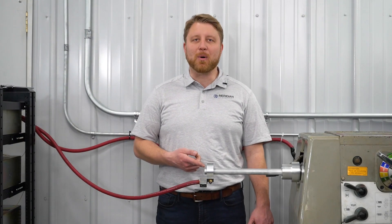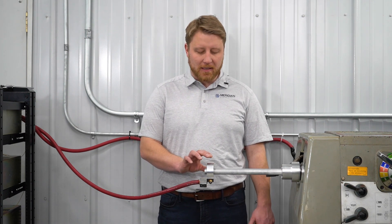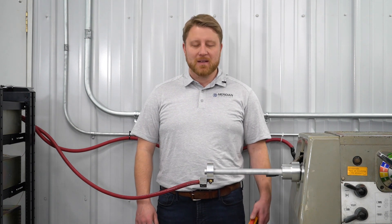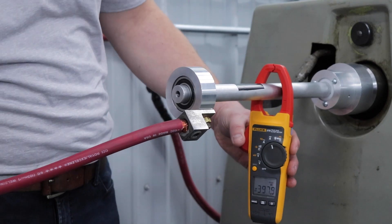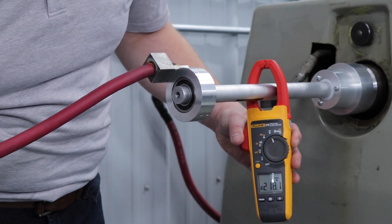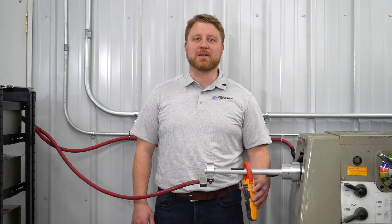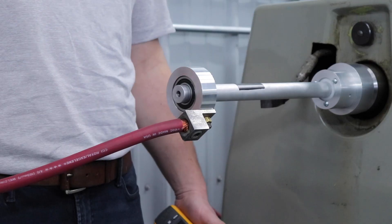Here we have the ball bearing and carrier assembly. Installation is done by pressing the ball bearing onto the shaft and attaching a ground lug to the carrier assembly. With the power supply still set to 400 amps, during rotation we can see that the carrier and bearing assembly fluctuates by nearly 200 amps, which is about 50% of the initial current it was set to. On top of this, it gets extremely hot and will eventually wear out.